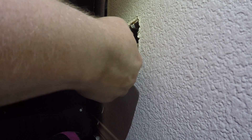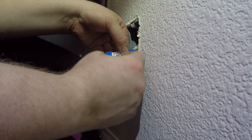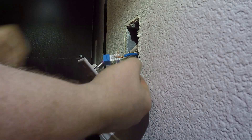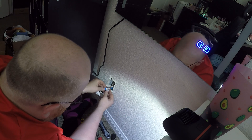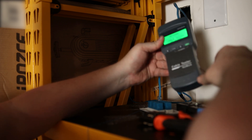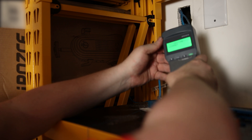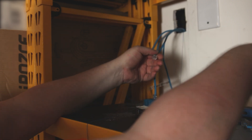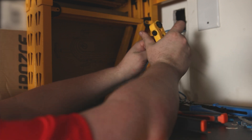I'm going to have a lot to work with here. I'll take one of these caps — that seats it where it needs to be so the wires can't pull out. I tested it and it works now. It was a messed-up type B and I've made it type A just like the other room. It's still not perfect but at least it's not showing X's — before it was showing X's, now it's just showing the numbers are mismatched, so it sees all the pairs. I'm going to do one final cut to make it a proper type A. That's a relief because that's the one room where it has to work.